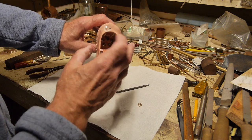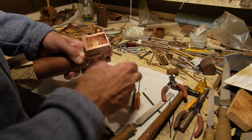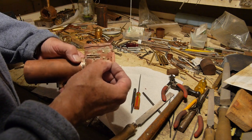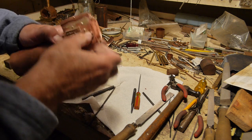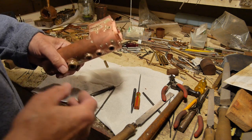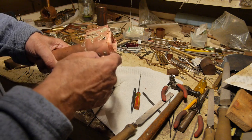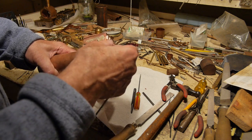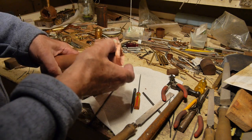So this fits on here like this — it's a little bit of a tight fit, as it should be. The foundation ring's in, back plate's in. I put a piece of wire around here just to hold the back plate more firmly against the foundation ring. The last piece is a bushing for the water gauge to go in here — it's in fine. Now what I'll do, as I've done before, is put some flux paste around all the joints here, because it's going to take quite a few minutes to solder all this together. I've got this joint here, I've got this joint here, I've got the foundation ring, and I want the flux to keep working all that time. So wish me luck!